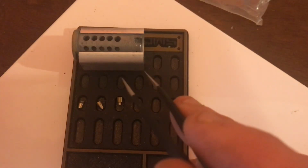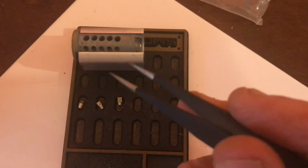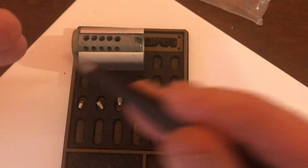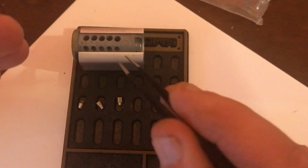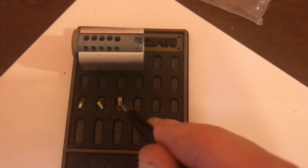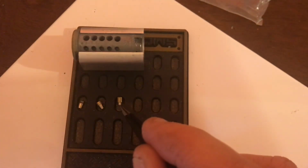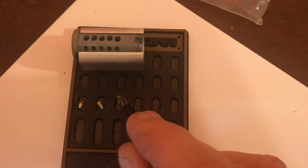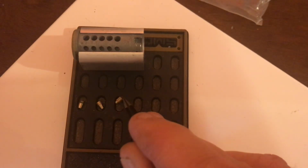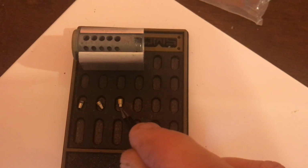You will often know, as the picker, the lock feels like it's at its tail end, and you're just going around and nudging all those key pins inside, and then suddenly the lock opens up. What's happened is one of those key pins has just given that T-pin the final little bit of nudge that it needed. But there's not really what I would call crisp feedback coming off of that T-pin.